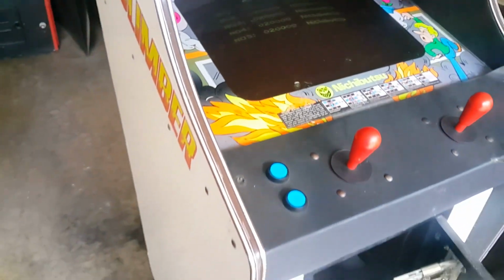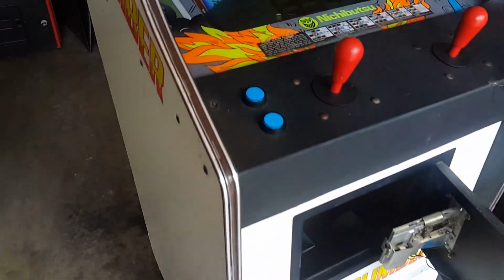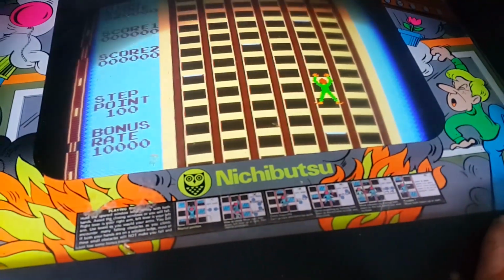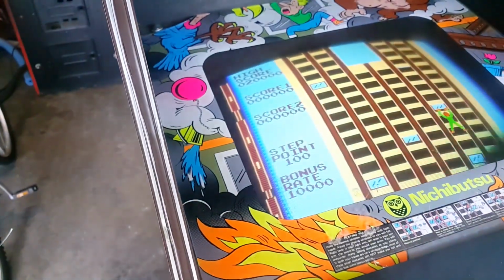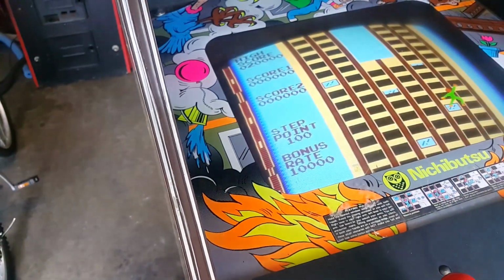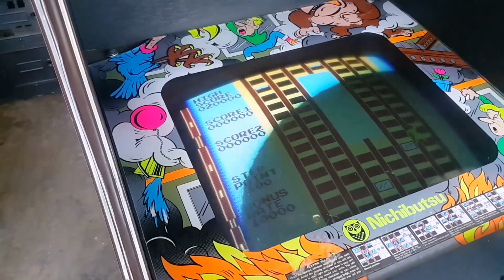Alright, I'm stopping right here. And I'll leave my ROMs below. You guys can play with them. Maybe there's an issue with the CPU ROMs. I had 1 ROM or 2 ROMs in the CPU board that didn't verify right. I wonder if I should burn those. I don't know. I gotta move on. Maybe we'll revisit this soon.